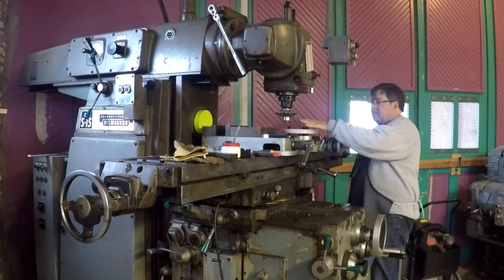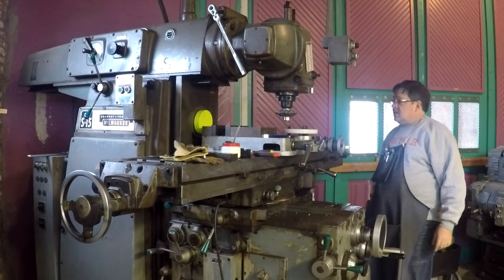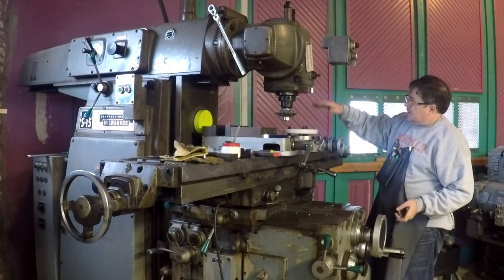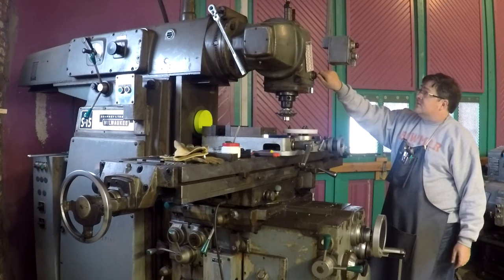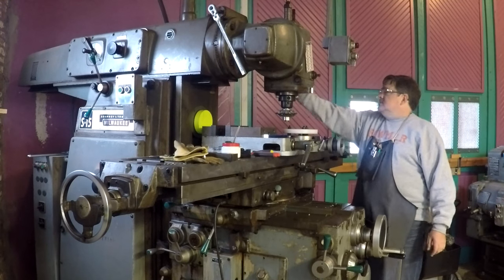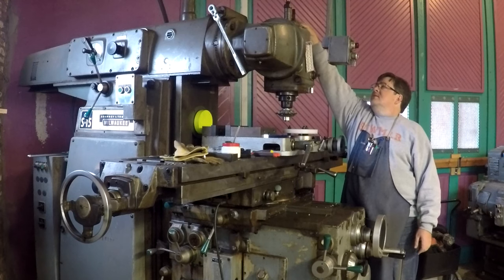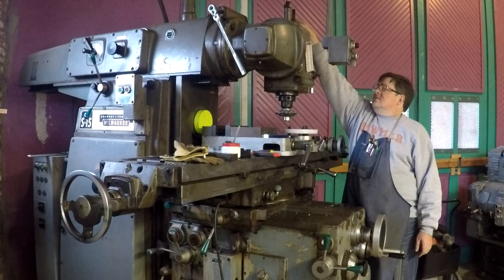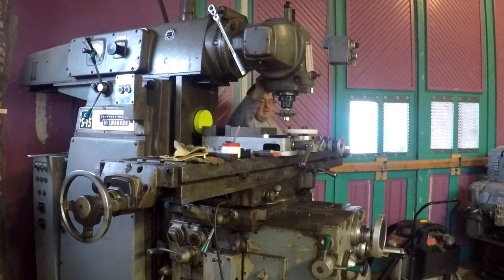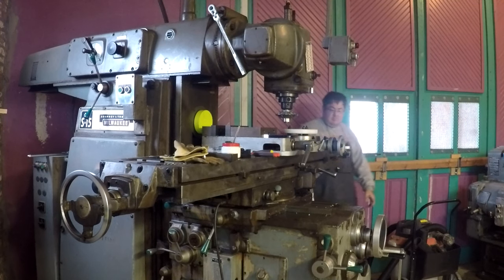So we brought our cutting head out, and now we just need to come up, and we're in business. Now I can bring it up. I can extend it up with the knee, or this vertical head also has an extending quill with a depth stop right here. I can extend it a little bit, I guess. Or is it locked? This is not a fast acting quill. This is the exact opposite. But you can lower the quill down.